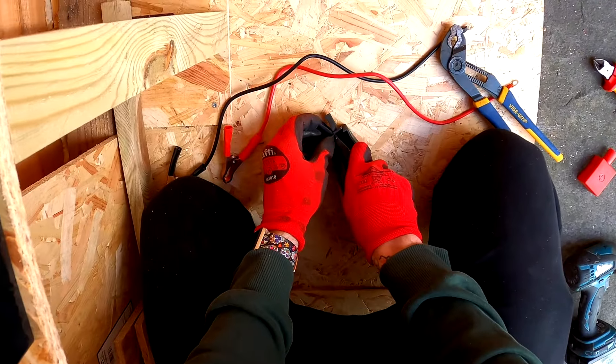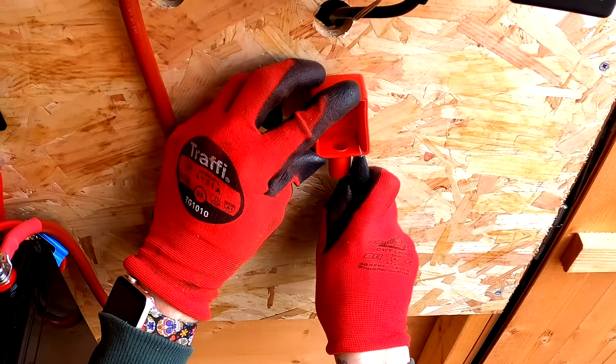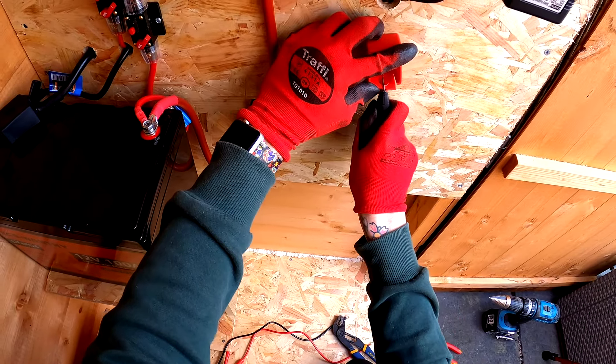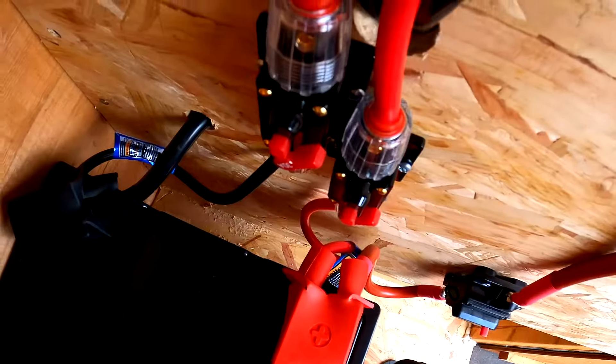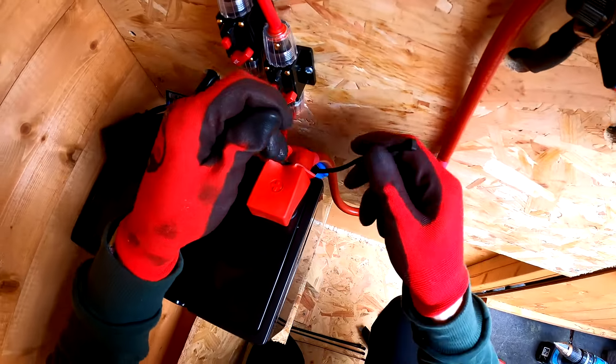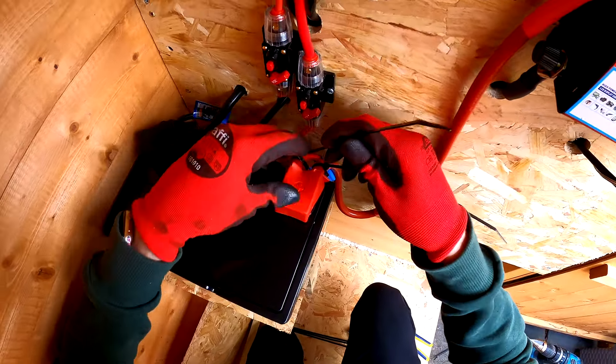As there are two wires connected to the battery, I need to cut these terminal covers to make them bigger. Here I've cut them up to allow me to then cable tie two of the flaps to the two cables, securing them into place — whichever way works best for you on keeping these in position. Then I've used plastic cable ties to go around the covers, connecting to the cables to try and seal them in position.